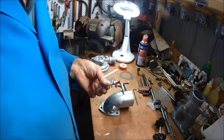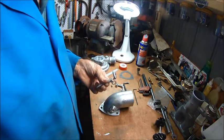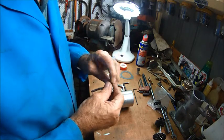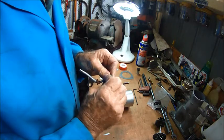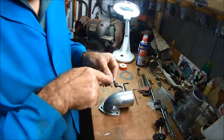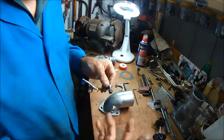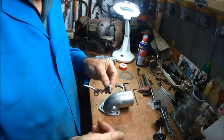This is the tube that's going to hold the nozzle. This is a Devil's Own nozzle. I've hand-threaded the tube — that nozzle will screw on like that. That will be Loctited on, but also this nozzle is going to be machined down to reduce the diameter and minimise the interference with airflow.